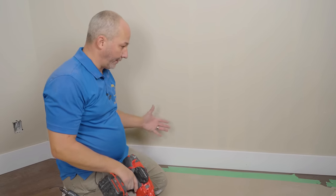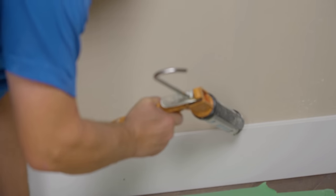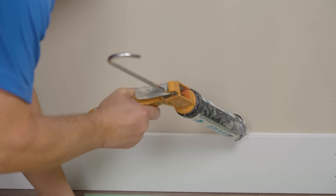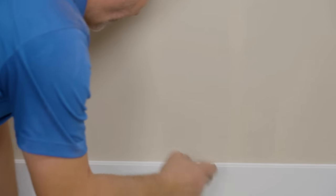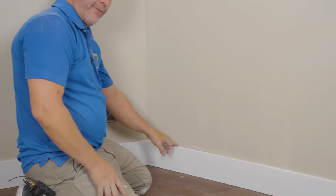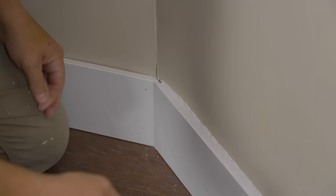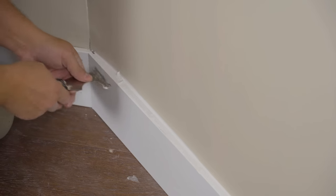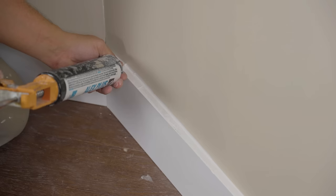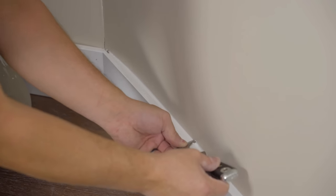Now we have enough time for the adhesive on the backside to do its job. As far as caulking is concerned, we have a nice small gap here — small tip. We're going to set the caulking on there, get it flowing nice. We're going to squeeze as we pull and it leaves a perfect concave line — there isn't even any need to put your finger in that. Slow down while you're recharging the gun, then squeeze again. If you make any issues, quick lick and wipe. For the outside edge, I'm using my finger to hold the tube away from the edge so I'm overfilling that gap. Then I come back with a tool — it has a concave corner on it — and I just snowplow and force that material into that gap and leave a perfect concave. You've got to trust the tool to do the job — hold it tight and pull it. Perfect caulking line.